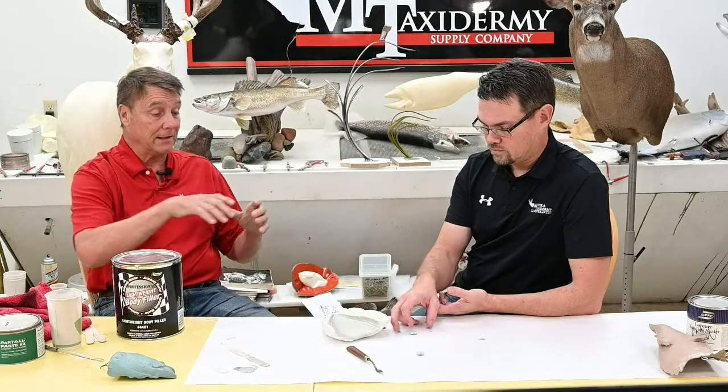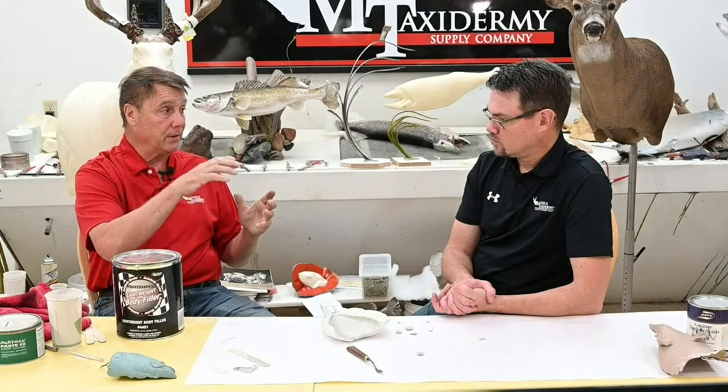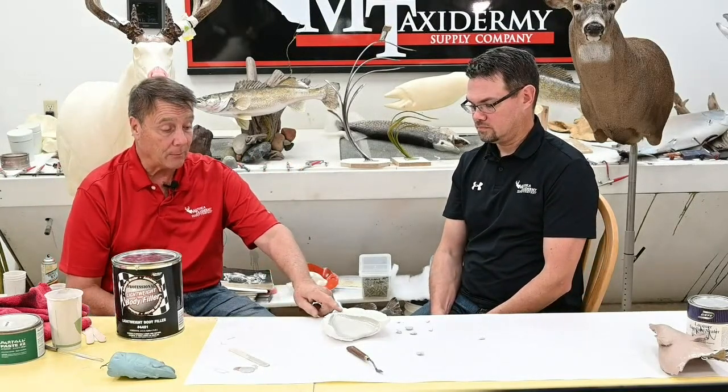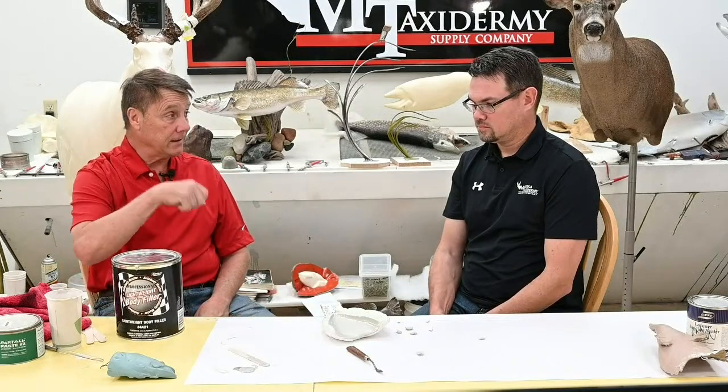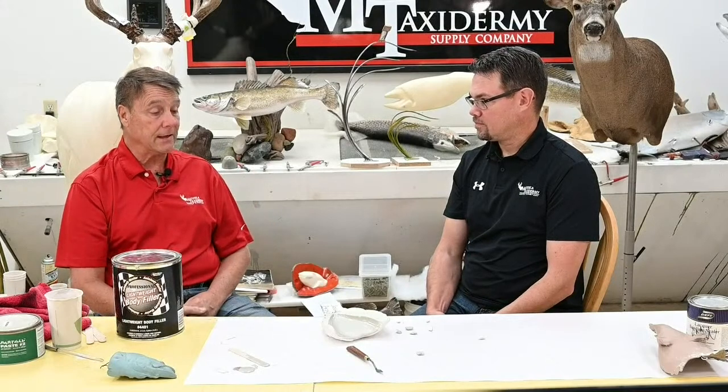to make a splash coat like we talked about last week. Make a splash coat and then a little heavier coat. Peel the fish out of him, and wash him up, put the fish back in, pour the other side, and you just made a mold that a reproduction fish can be made out of. Treat that mold exactly like Brett was talking about. Sanding sealer. You're going to want to put a mold release on it so your material doesn't get all over.